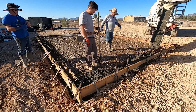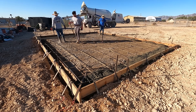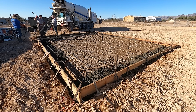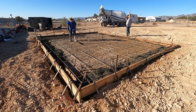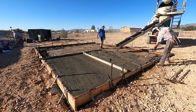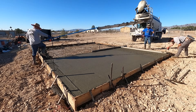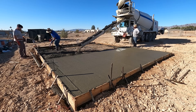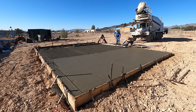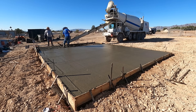So that was interesting. The inspector came back — he was only gone about an hour and a half. I called everybody: the engineer, the building department, everybody to figure out why I couldn't get this passed. He ended up coming right back and they all figured out that there is a torque test on expansion bolts that has to be met, and that's why there's a special inspection. You'll see the special inspector out here as well testing those — but that'll be in the next part after the build. In this video we're just going to show the concrete placement. I'm doing a green color hardener and then I'm going to power-trowel it in.